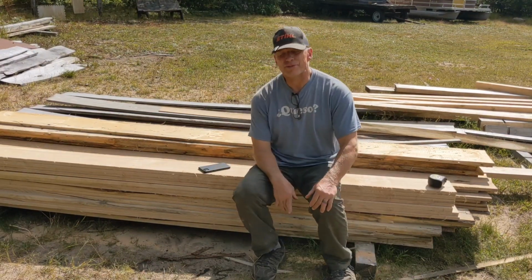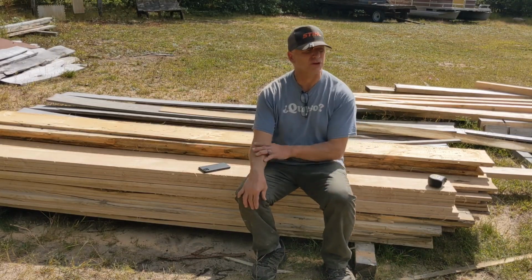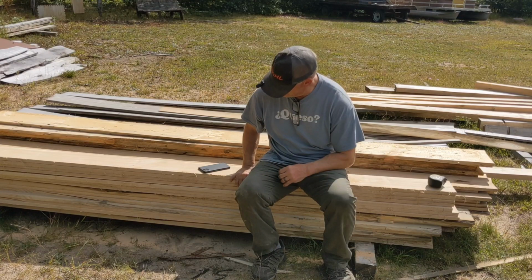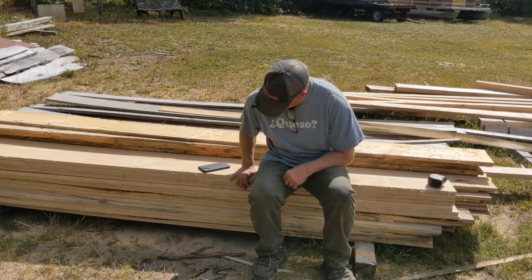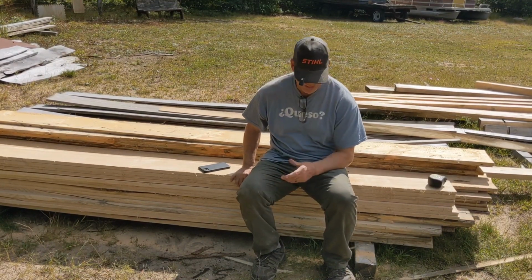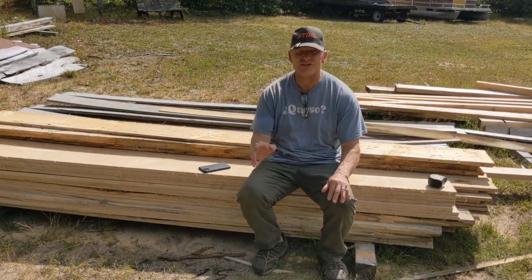Well, I just did the math, guys, and we're at 73 board feet. So we're pretty close to that Doyle scale. I think we did a little bit better. We have 11 boards, 3/4 inch by 6 inch by 110 inch. And then we had 6 boards, 3/4 inch by 9 by 110 inch. So approximately 70 board feet, 73 according to the calculator, but yeah, around 70-ish.